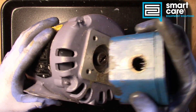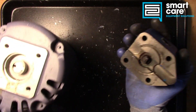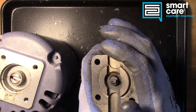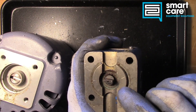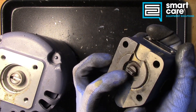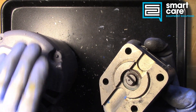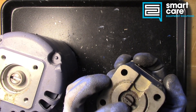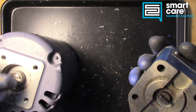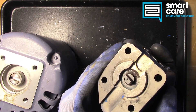When these are assembled and in use, they go together like this, and there are bolts that bolt the pump to the motor. On older machines, one of the failures we used to see in the field was this seal failing. The pump itself has a hard life — it goes from cold to hot every time you run oil through it, and any debris or grit that gets through the filter paper ends up grinding or eating this seal. So this seal would fail, and on old pumps they did not have these slots. There was a gasket here that sealed it to the motor face. The oil would shoot out of this seal, fill up this space, and then inject itself into the motor, and once it hardened, the motor couldn't turn. Then you would have to replace the filter pump and the motor both.